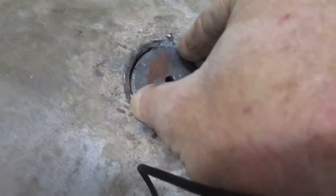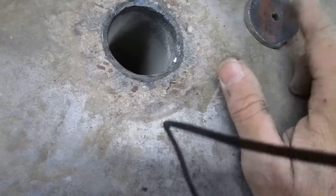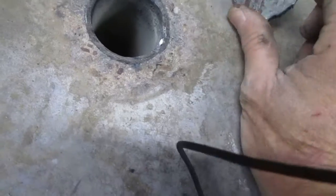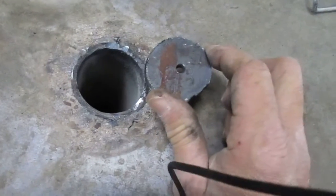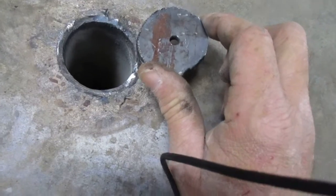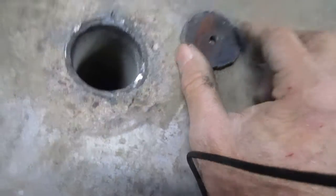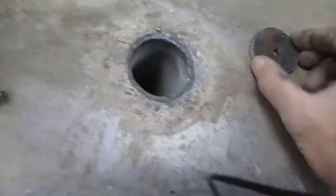Look at there. Now I got to have a ground — I'll weld on a little piece of metal here to get my ground. And then that little hole right there, you know the little saying amongst welders: if I can step across it, I can weld it. So I can dab that with some welding rod and close that hole up real easy. Yeah, this is going to work.